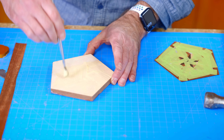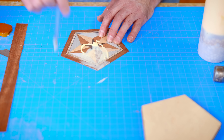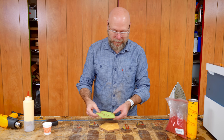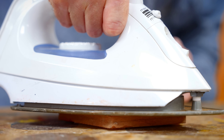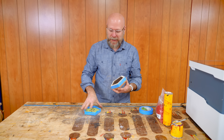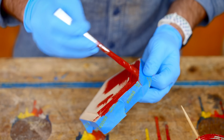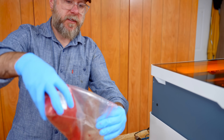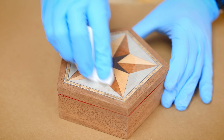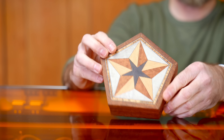We're going to use wood glue for this — put wood glue on both pieces and let them dry. Now that the wood glue is set up on both pieces, I should be able to just iron this on the inside of the box. We're going to flock it — it's going to give it a nice fibery feel, cover up all the plywood edges, and make it look classy. That came out really good. That doesn't look like it was made with a laser; that looks like it was made by a fine woodworker.